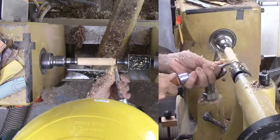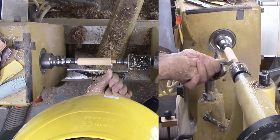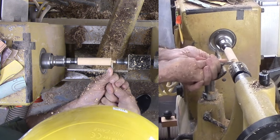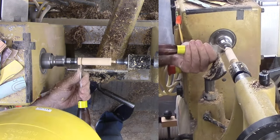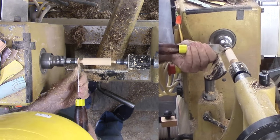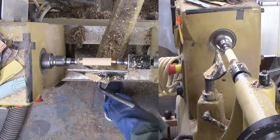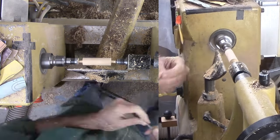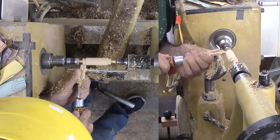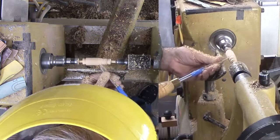Now I have a small piece of scrap maple mounted between centers for the stem. I like contrast on a three-piece goblet, such as with this maple against the walnut. The first task is to cut quarter-inch tenons on both ends of the stem. This is easier on the live center end since the live center interferes less than the stem-style drive center. After reducing the diameter, I finish up with five-eighths and then one-quarter inch sharpened end wrenches. These leave tenons slightly oversized, which work well by either drilling out with a one-size-larger drill or just pressure if the wood can tolerate it.